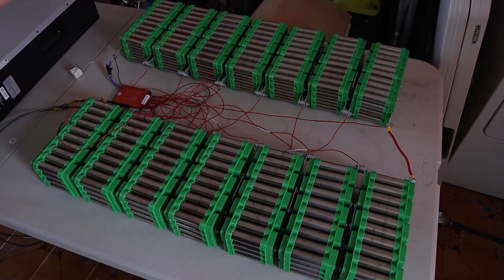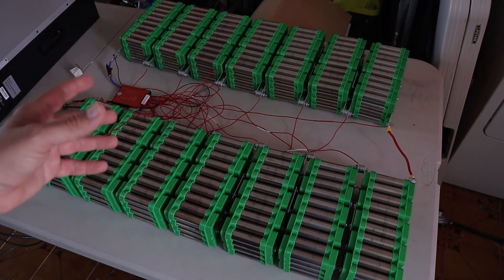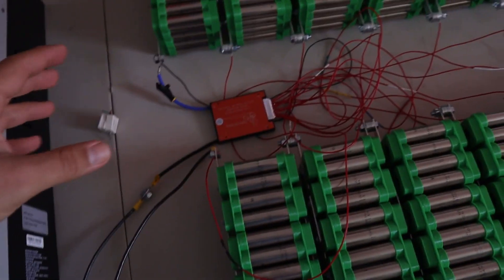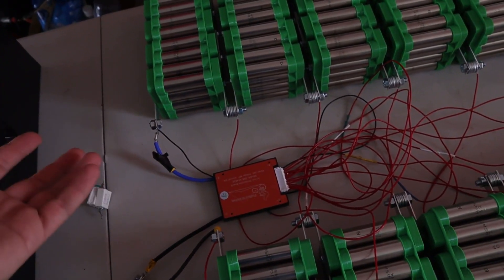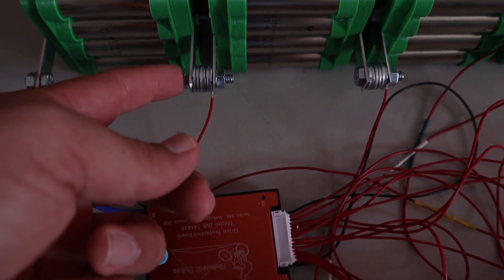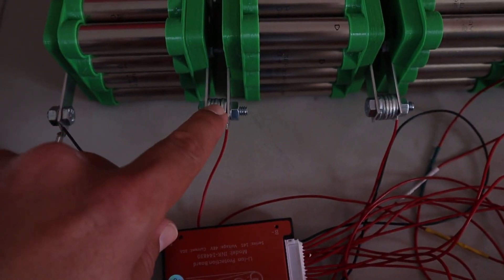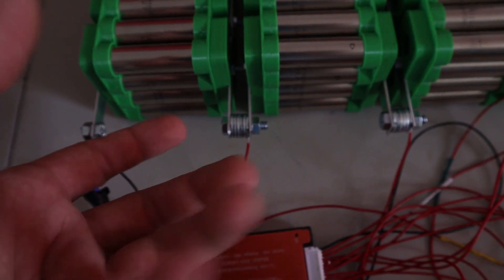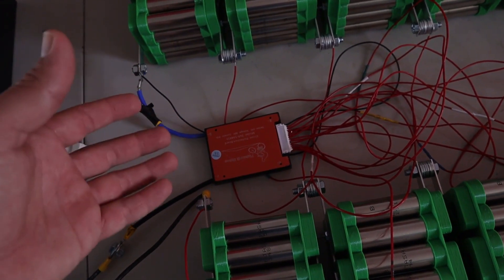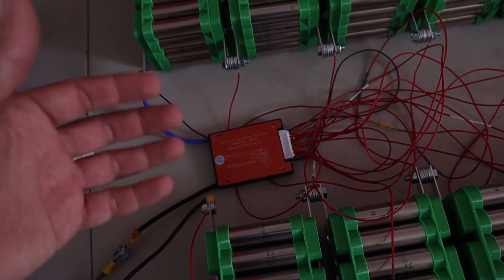By the time I came in I started to do the assembly, then I had to go out and buy some food, and when I came back the power came back in. So I was using my backup power wall. This is a fairly simple setup — not the way you're supposed to do it, but just to give you an option. As you can see, this is just a simple screw with nuts and some washers as spacers. This is my main negative, this is my main positive, and this is the BMS — a small BMS rated for 30 amps.